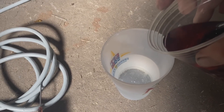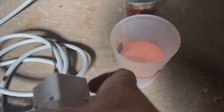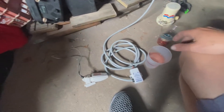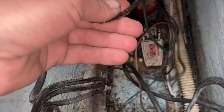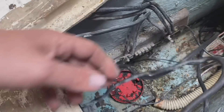Even with a little bit of fuel mixed in with bilge water — since my bilge always tends to have a little fuel in it — the bilge pump still turns on, which seems like a pretty good product. I think I'm still going to use my normal float switch though, because this one seems a little more complicated to wire up. I really need to clean out this junk before I put things back in — I'm going to get the vacuum and a brush. Some of these wires just loop back and attach to the same point, which is needlessly confusing.